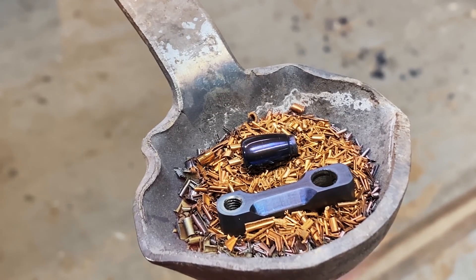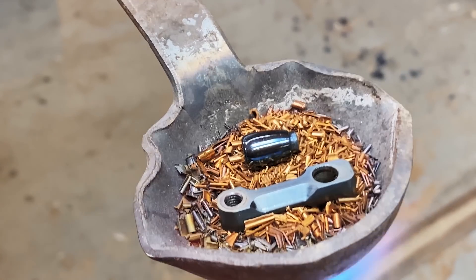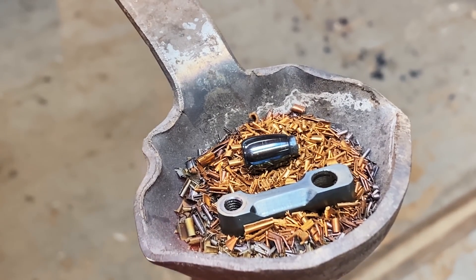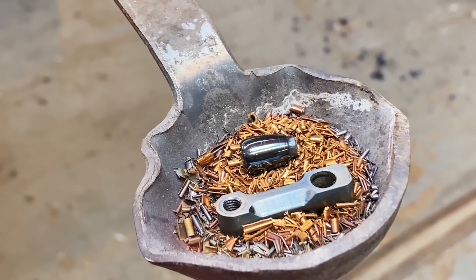This takes a while. You can see the brass chips getting darker and the steel kind of smoking. Then all of a sudden — there it is! It's getting yellow and now it's turning the same color as the brass — this is so cool to witness. The crank handle is getting darker, we're getting almost like a purple. The blue is getting deeper, and Chris on ClickSpring is totally right — this is a magnificent method for bluing, it really evens it out. It's also made it really clear how high a polish you need to get something to in order for it to still look polished once you've blued it.